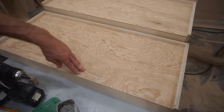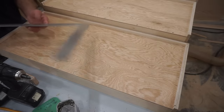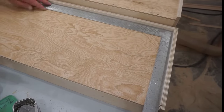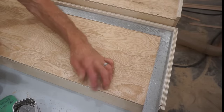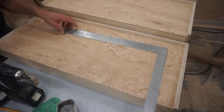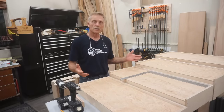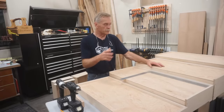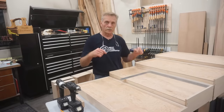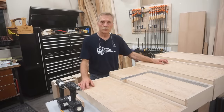One thing I take for granted when doing drawers this way with accurate parts and a systematic process for fabrication, when I put the drawer together, slip this bottom panel in there, the drawers just come out perfectly square. I don't have to hold them square and drive screws to hold them that way, or shim or glue or nail it all the way around to get things squared up. They're square from the get-go. So the time I spend early in the process squaring up edges and making sure everything is accurate, it pays off now because things slip together and come out as close to perfect as they can get without a bunch of extra fuss at this stage of the game. It makes a lot more sense to do the fussing up front so that the end game goes smoothly.